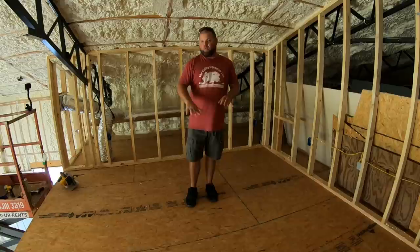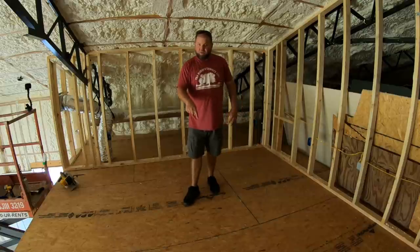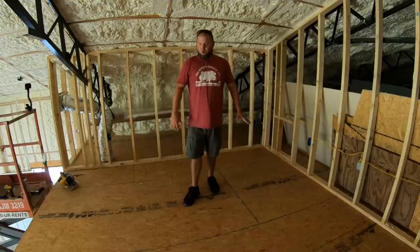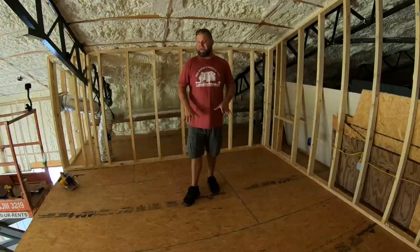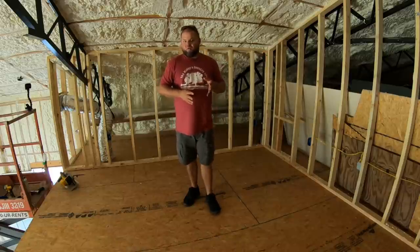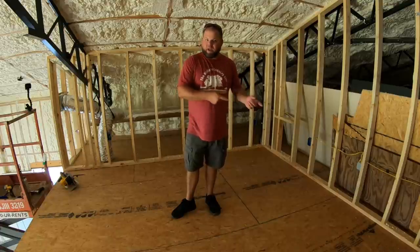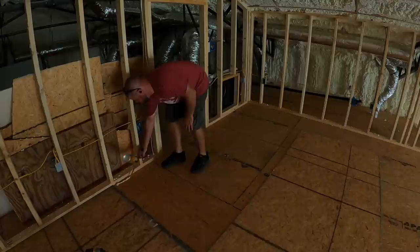But now that I'm going to lay another 4x8 sheet down, I'm thinking I'm going to go the exact opposite direction again. So the boards that are underneath have strength this way, the boards on top going this way are going to have strength, everything's glued together. It should make an unbelievably strong and hopefully flex-free floor, so we don't ever hear any issues, creaks, or anything downstairs. Although keep in mind, what this room is intended to eventually be is an office. I don't plan on being up here very often, all hours of the night. It's not like this is a bedroom where we're expecting a tremendous amount of walking and we're downstairs trying to sleep, somebody up here creaking the floor, banging around. That's just not going to be the case with this room.